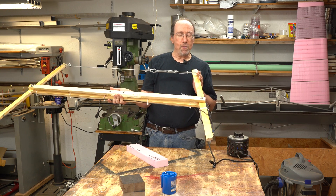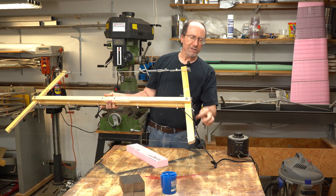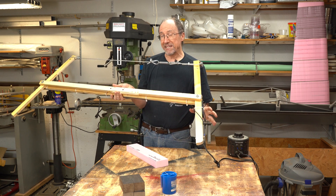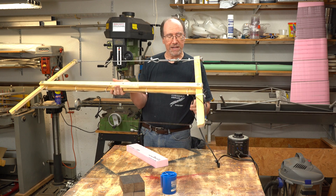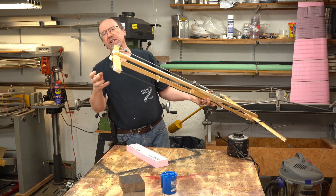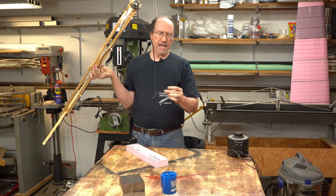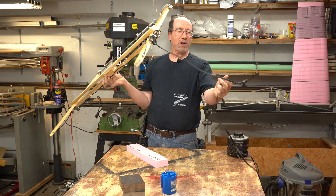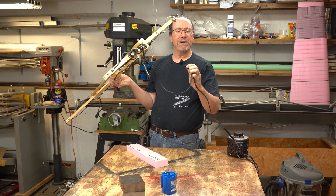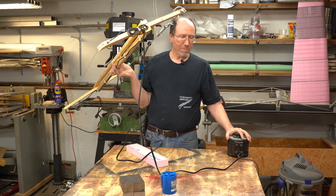To feed the electricity to the hot wire: on this end there's a little feeder wire — I had a little extra so I bunched it up. This wire is something very similar to lamp cord — I had an old space heater that died so I just cut the electrical cord off of it and used it; it's about six feet long. On the other end the feeder line comes up and I zip-tied it to my cross piece, then added another piece of electrical cord because this clearly wasn't enough wire. This hooks up to my transformer.